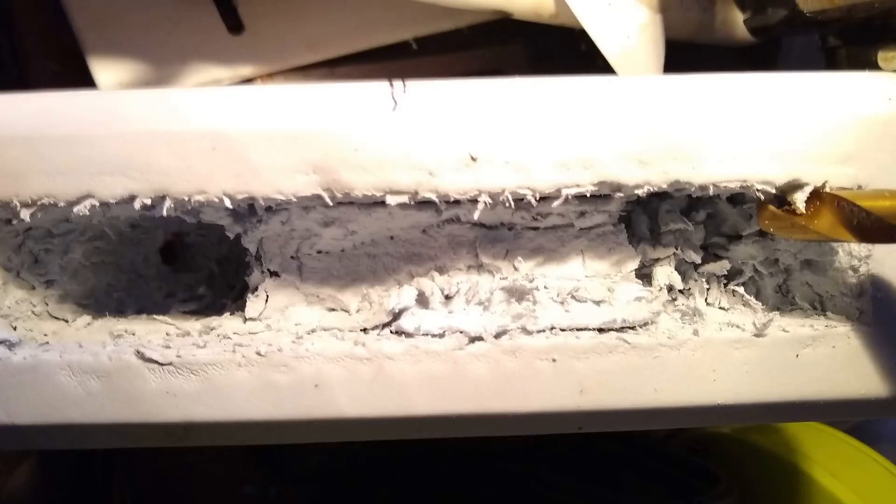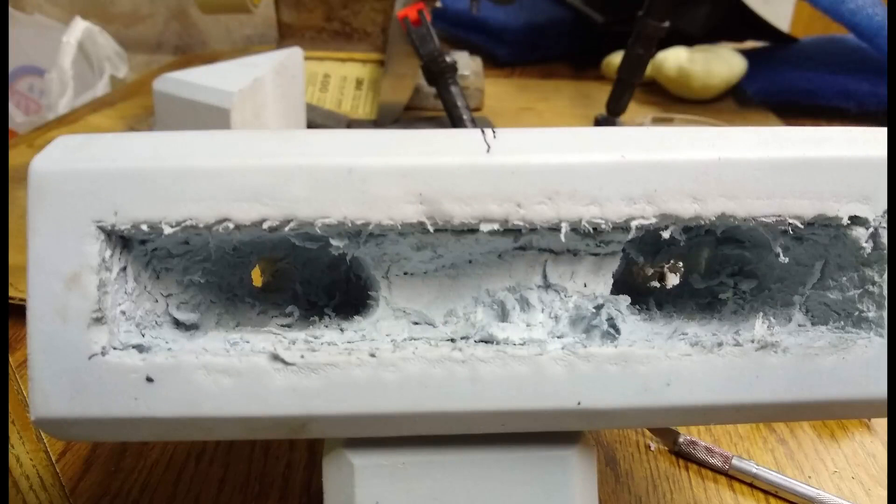Once I had a door, I went back to the drill and started to bore out a channel from the back down to the side hole. The channel was about an inch and a half wide, that way I had plenty of room to work the mics into the hole. When boring out the channels, remember to go slow, keep cleaning out the holes to see where you are, and drill parallel with the outside angle so that you're not drilling straight down and coming out the side accidentally.